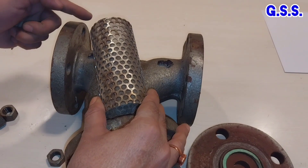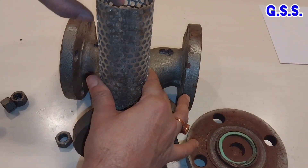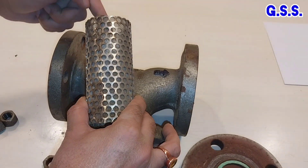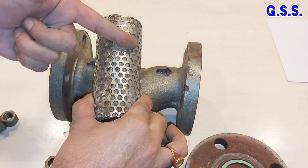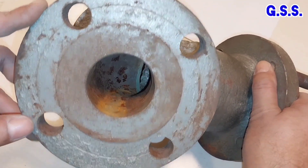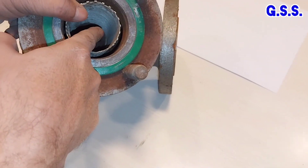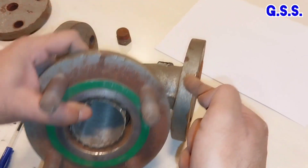Flow comes like this and enters to the inside of the cylinder. Inside, wire mesh is there, and on the outside, a perforated SS seat is there. So first, fluid enters the cylinder and gets screened by the wire mesh. Then it comes out from the perforated seat and goes out. During operating condition, fluid flows from inside the strainer to the annular space, gets screened, and goes out.